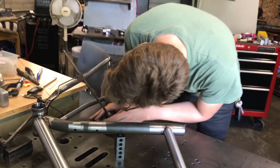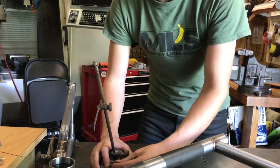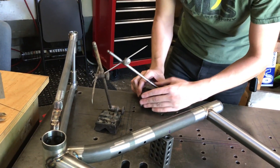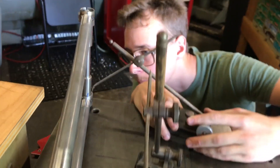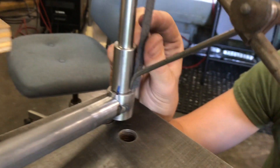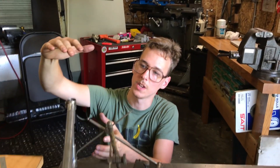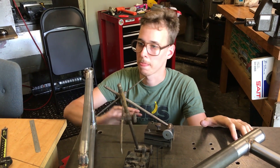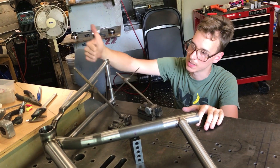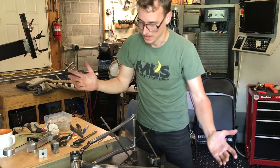I take a measurement here — that's pretty dang close. It's not perfect, but I'd say within about a millimeter, probably less — maybe 20 or 30 thousandths of an inch, or about 0.7 of a millimeter somewhere in there. It's just eyeballing. If I look down here, this is a bigger gap — more like three millimeters. So that lets me know that the rear wheel is sitting toward the non-drive side. I'm not really that worried about that. I'm just going to use weld sequence to weld on this side of the frame first — it'll pull the chain stays this direction. As for the weird-looking joint here, I'm not sure what that's about and I'm not really sure how to account for that.